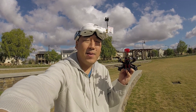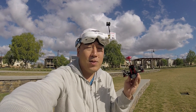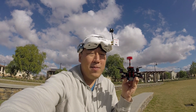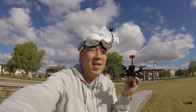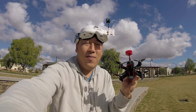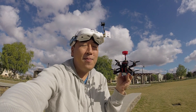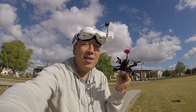This thing flies exceptionally well. It needs a little bit more tuning — I need to lower the P a little and maybe increase the D. The rolls are very snappy, and the rolls and flips snap and stop on a dime, so it works really well. On full throttle punch-outs there's some oscillation. I wasn't able to get into the PID changing menu in the OSD — I think I might not have enabled that feature, so I'll have to check that, but it should be a simple change. Let me know if you want to see more videos or demos. I'll put a link to the frame in the description. Let me know if you have any questions, and I'll talk to you guys in the next video.